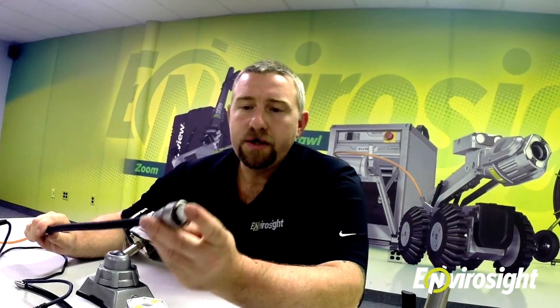Once your termination is done, you can do further testing with an ohmmeter. Ohm from this end of the cable to the inside connector to make sure all your connections are going through and none are shorted together. You won't get a short between your CAN lines because there's a 120 ohm resistor in this connector — that is normal. But make sure none of your power lines are shorted to either your CAN or video lines. If they are, do not plug the system in and power it up or you will burn out boards. Thank you for taking time to learn how to re-terminate your Rover X crawler cable. If you have any questions, please contact us at the EnviroSight Service Department or reach out to our nearest EnviroSight authorized regional service center.